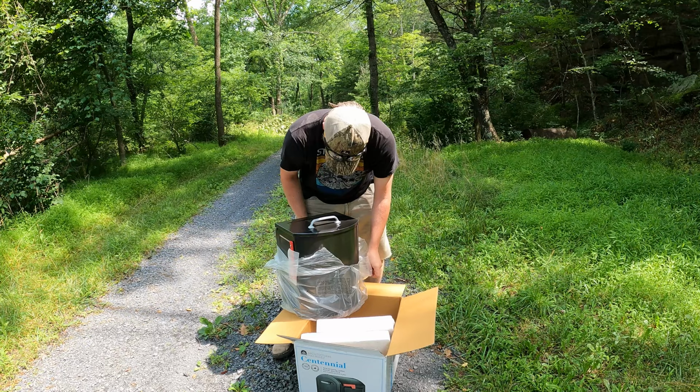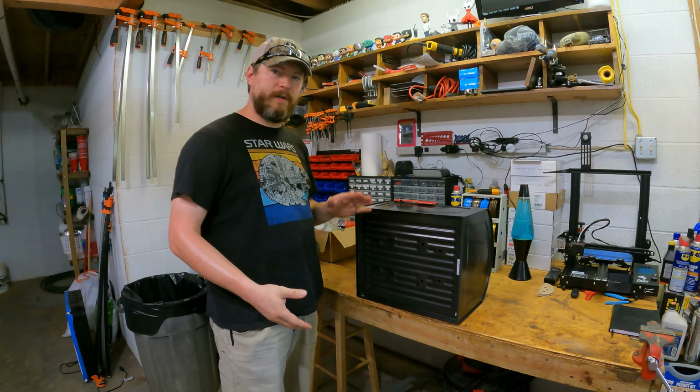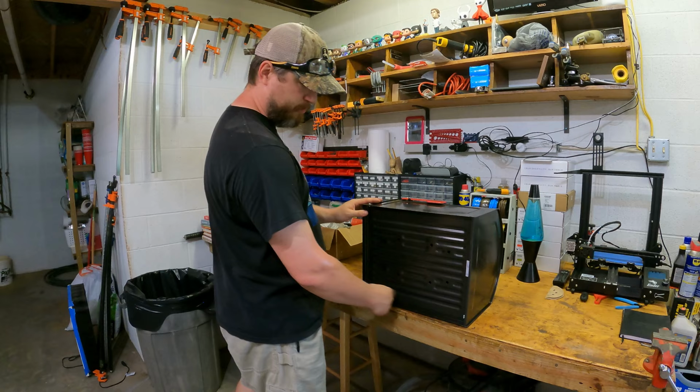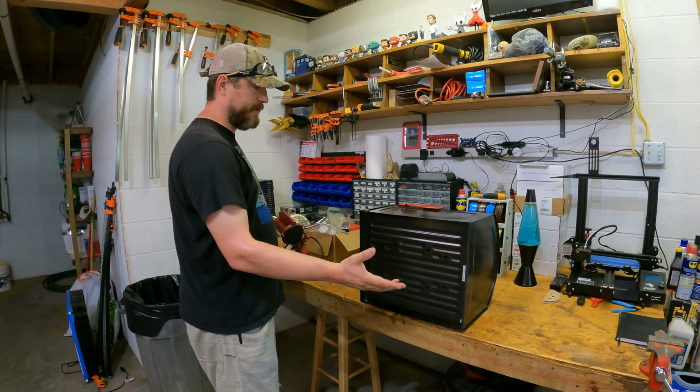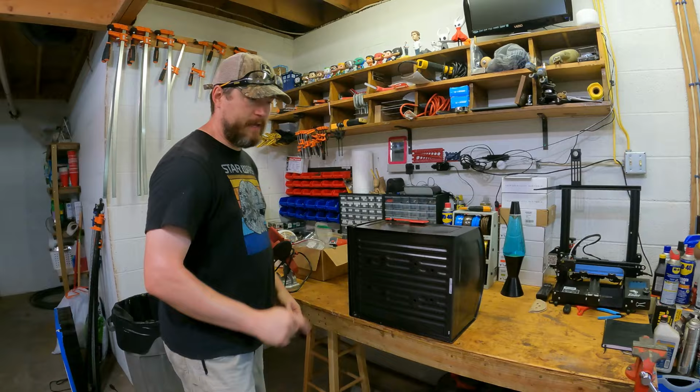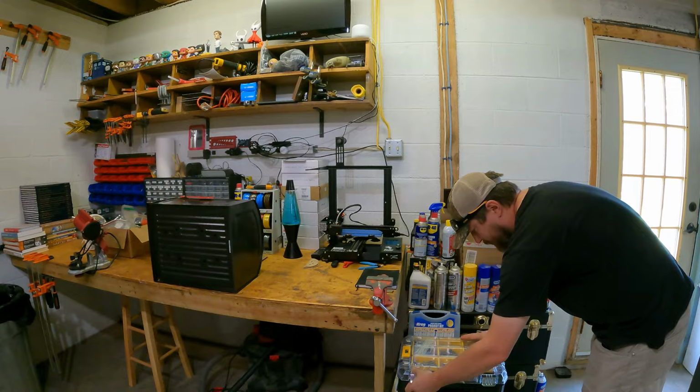We went up to the post and we found that there was a board underneath the old one, and that board's too long. It's just wide enough actually, but it's just too long. So what I'm gonna do is I'm going to actually cut a new board out to sit here. But also the mailbox did not come, and this is good to know, it did not come with any hardware for actually attaching it. So what I need to do is I need to look for some pretty solid hardware that I can use. And I think what I'm gonna end up doing is I think I'm going to use just some standard deck screws.